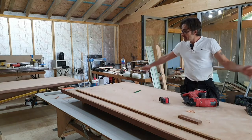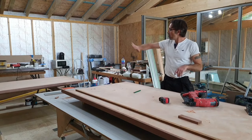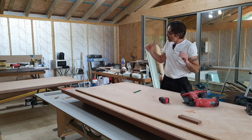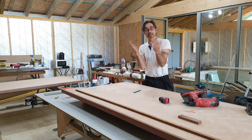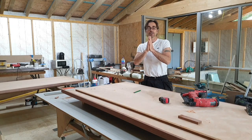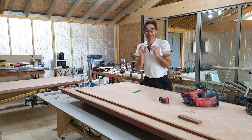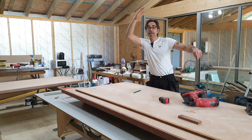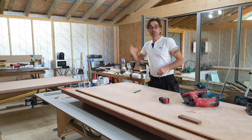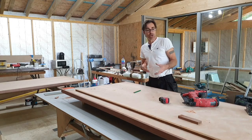I'm going to clean all these up on both doors now. That one's been going off for a good hour so I'll clean it all back, inspect it, make sure it's nice and flat — keeping it flat is the other crucial thing. When I'm stacking these, I stack them corresponding face to face, so if they have any movement they'll move together. You cannot keep things flat and straight forever — you've just got to think ahead. Don't lean doors unsupported, and don't leave them unsealed with moisture on one side and heat on the other.